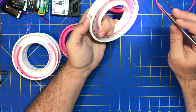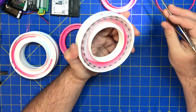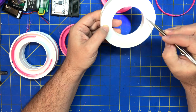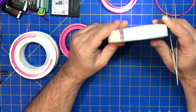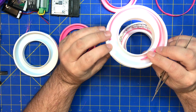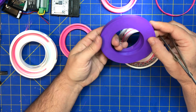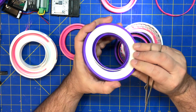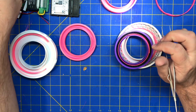Well, that's that. Did I print 2 of these? No, just the one. I also was modifying the bottom thickness. This has got some print problems. I don't know why. This should have come out pretty good, but it didn't. So I gotta figure that out. My bottom's coming out real thin. The first couple I printed came out really good. Might be the print, might be the filament. I mean, it's a little messed up. This is right at the maximum size of my printer, so it's hard to get that first layer to stick. My bed's not perfectly level. It's warped.